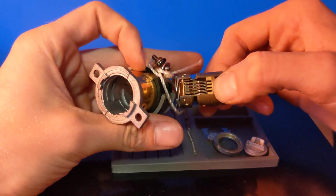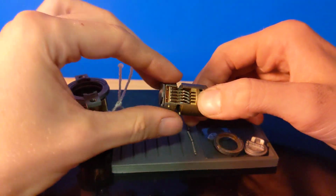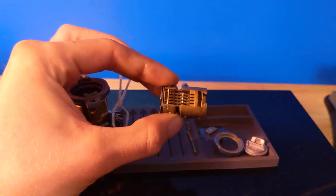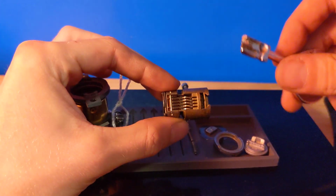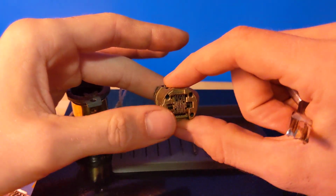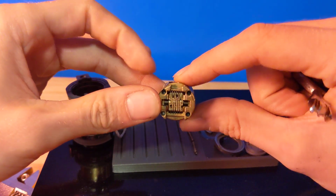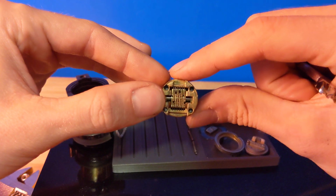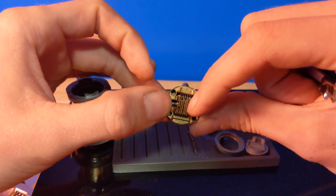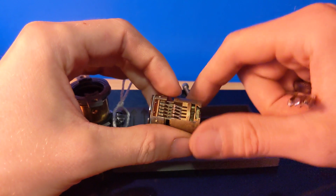You can see the grooves on the inside of the cylinder that piece runs in. On the outdoor cylinder, that piece is, instead of just a solid tab, a two-piece part with a spring in the middle, and that spring allows it to compress, and the housing is a little different as well. As the core of the lock moves backwards, the housing pushes that little tab in and it rubs against the cogs back here. That's only on the outdoor cylinder, but it makes picking much more challenging.